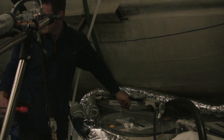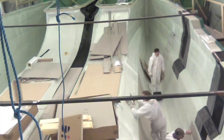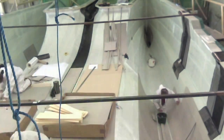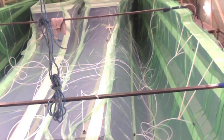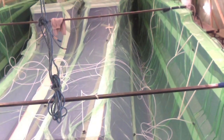For an infusion process it gives you the advantage of getting rid of the manual mixing operation and processing the resin directly into the mould in a controlled way. All the fibres have been laid into the mould dry with a foam core. The blue material on the top is a flow medium which helps the resin to disperse across the laminate. The vacuum bag is down from the peel ply, which helps communicate the vacuum and also makes sure that the internal finish is good.